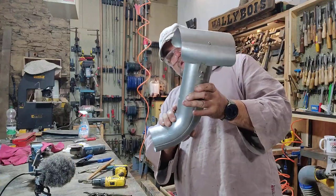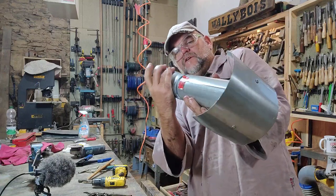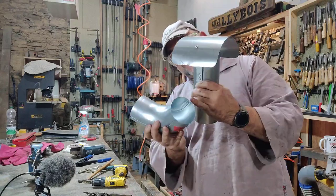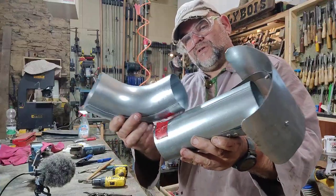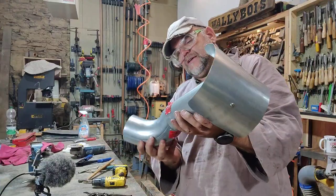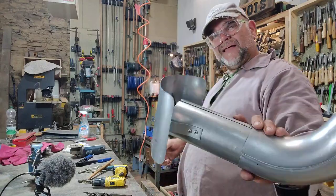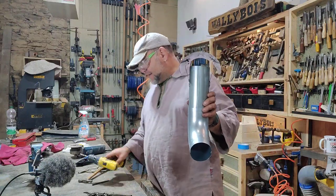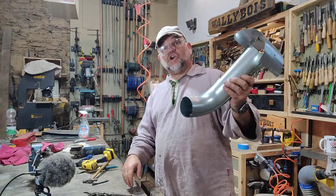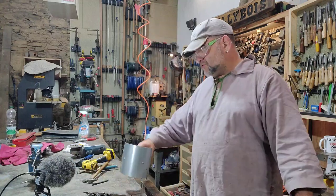That pipe coming out of the wall, that goes on the top of there. A bit of gas seal or whatever you're going to do to sort the water running down. Normally you'd have it going the other way up, so the water hits the cap, runs down and outside the pipe and not inside. So I'll probably have to cut it off here because there's a reducer — that'll go inside there. Then that's going on the end of the pipe. So you've got the pipe coming out of the wall and you've got your flue cap. That'll last a few years, depending on your pellets — if your pellets have got loads of corrosive material in them, that could cause deterioration of the pipe.